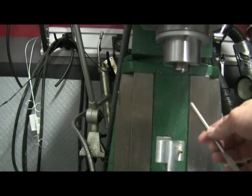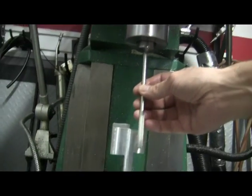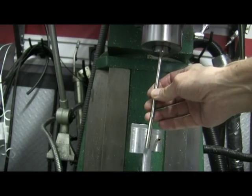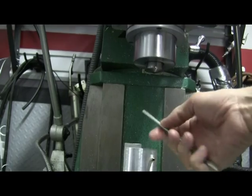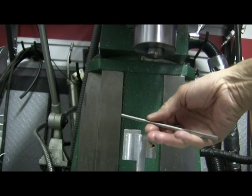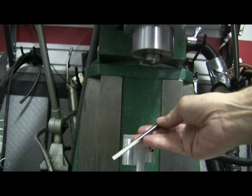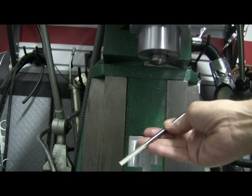Here it is. All I have to do is insert it in the collet - you can see the collet - but uh oh, there's no way to do it. I could chop this shank off on this reamer, or I could buy a short reamer. Trouble is I couldn't find any short reamers except solid carbide reamers. I found a 0.261 solid carbide reamer and it should be here today.